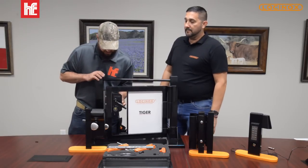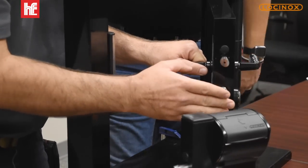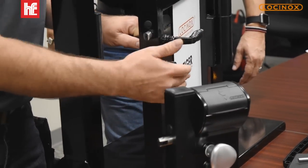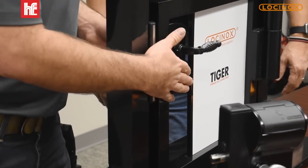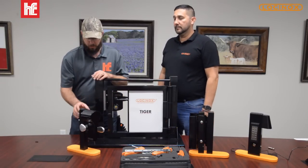Very nice. So we can take a look at this one here, and you've got the day latch, which is field handleable, and we've got the deadbolt down here, so you don't have to worry about any kind of credit card or shimming, anything like that. That's going to be operated by the key lock. You could also put a thumb turn on the inside if you wanted to for safety reasons, or you can use a double keyed mortise cylinder. You need an inch and an eighth cylinder to operate these and make them work in the field.